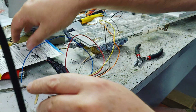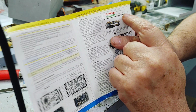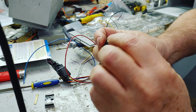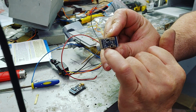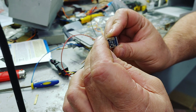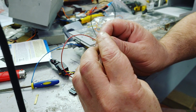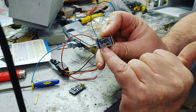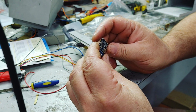Now it shows you in the little manual here that you need the 21-pin adapter board with the wires if you want to do this. That's not necessary. You will see that on the I/O board there's a hell of a lot of little pads here. On the I/O, you'll see all those pads here. If you're handy, you can solder straight onto that, with your speakers being at the top, your motor control, your pickup left and right, all over there as per normal. But then at the bottom here, I'm not sure if it's the other way around. I'll have to check. No, I think it's that way around. So you solder all your stuff onto little solder points there, and then the first 5 here you wire this smoker to, and then you just program it to be able to do the dynamic smoke.